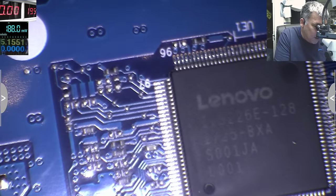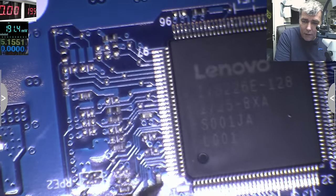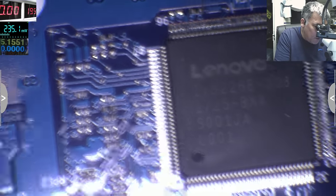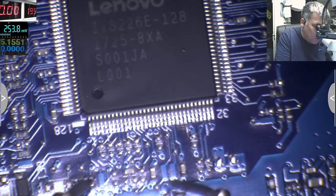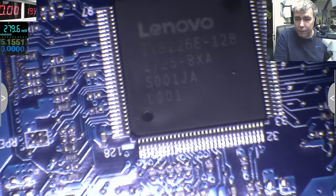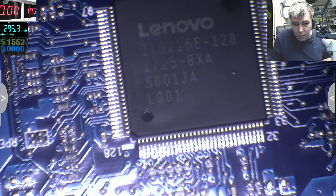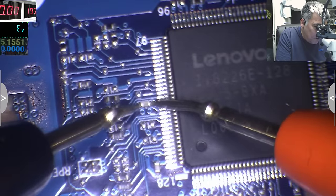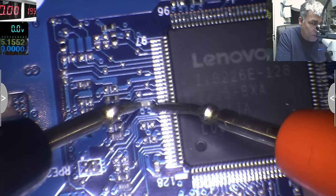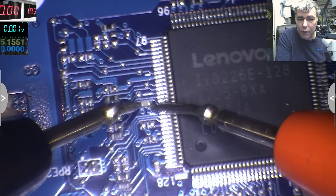You see, this is a ceramic capacitor, can you see them? This one, this one, ceramic capacitor, these ones, ceramic capacitors. Okay? So let's check together. Multimeter, let's switch the multimeter on ohms. Diode, yeah? This capacitor. Good, it's not shorted. Oh no, check on the multimeter.